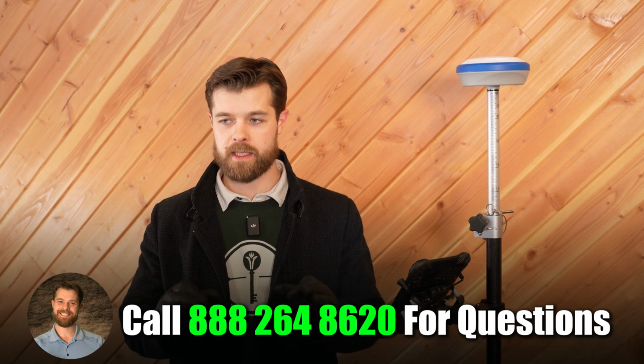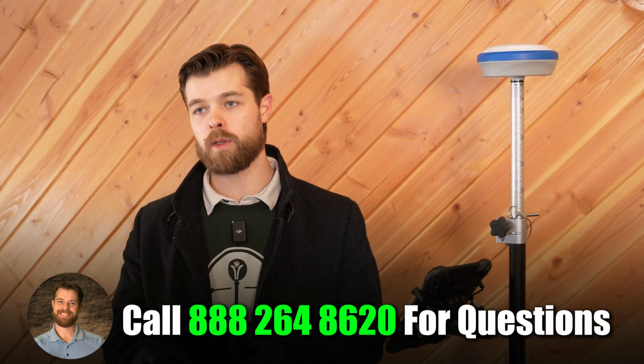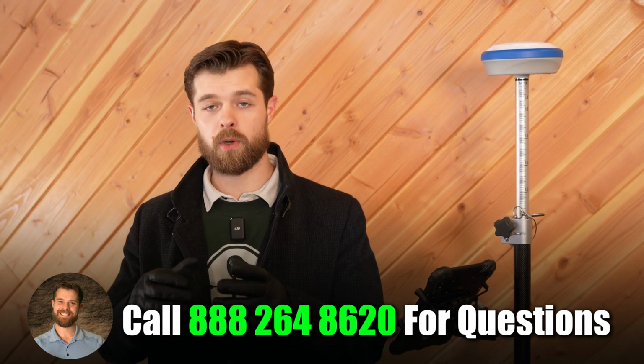So one final thing that I want to say before the end of the video is some people have the misconception that if you're using a network, you don't have to localize to the project that you're on. That's not true. To get precise and accurate measurements, you should always localize to your job. I will put a link in the description for a video specifically on localization, but in short, localizing is just tying into known local coordinates so that your measurements make sense with the measurements that have already been taken.